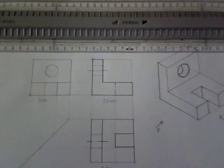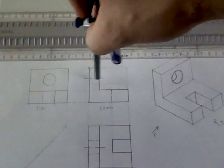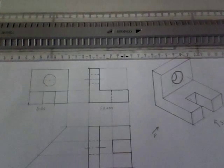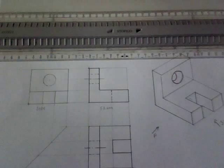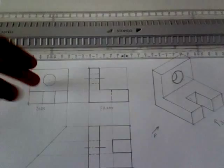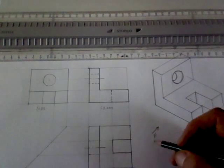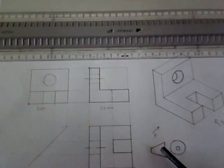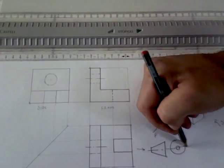So there's my front, side, and plan in first angle. What I failed to mention is that the setup — that is the presentation of front, side, and plan — is that the distances between each view should be spaced out equally. The distance here, here, and here to the edge of the paper should be split out equally for a better presentation. Even the names of the views should be done with proper lettering. If you're looking from the right, you place it on the left in first angle. The symbol for first angle projection looks something like this — it's a frustum, a truncated cone. If you're looking from this angle of the frustum, you see two concentric circles, and that's the symbol for first angle.